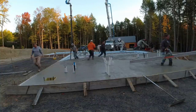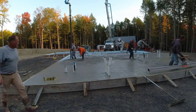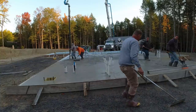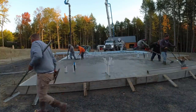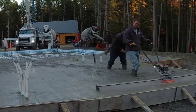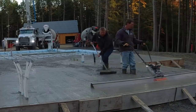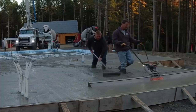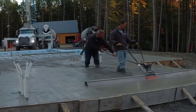The tricky thing was walking in this stuff. They had wire mesh down with radiant heat on top of it, then a few other pipes running on top of that here and there, and then there's rebar in this two foot on center that's up on slab bolsters about four and a half to five inches tall. So we're trying to dodge all that stuff while walking in concrete ten inches thick.